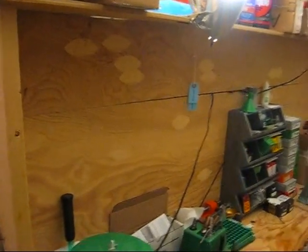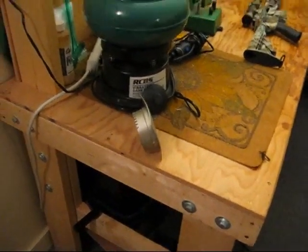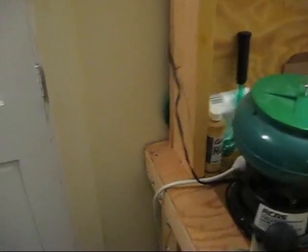I was able to have it come through the tabletop, which I'll show you in a second, and bolt it to the leg, and run bolts through the 2x4 for the top plate, the leg, and the main arm of the shelf. So I cut a hole in the tabletop, slid the 2x6 through there, and bolted it all together. So I can undo the bolts, take the entire back piece, pull it up out of the bench, set it down, undo the rest of the bolts, and take the legs off the tabletop and move it around.